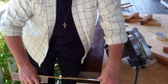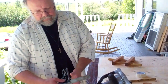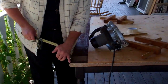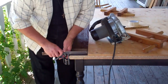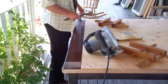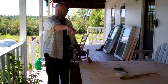You can take that number and then do some tricky measuring, but that's harder. The easier way is to set up a square — just a sliding combination square. Set it up for the width you need to where the cut's got to be, plus the thickness of what has to come off. Then you can simply put it in place and it is exactly where it's supposed to be. Now that everything is clamped in place, we're going to saw this edge off, a mirror image of what we did on the end.